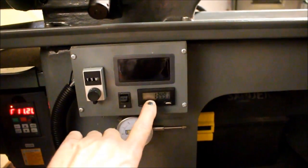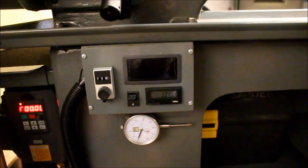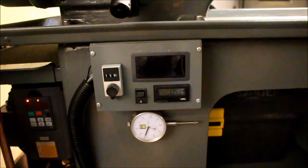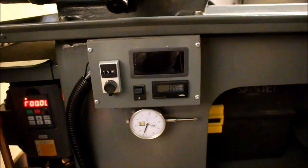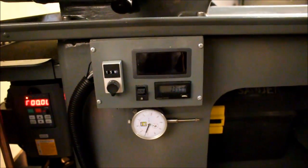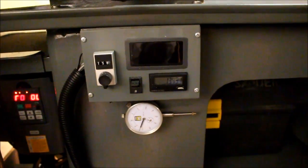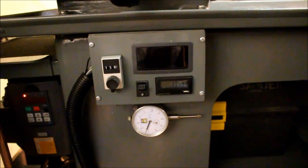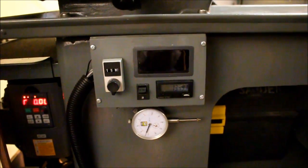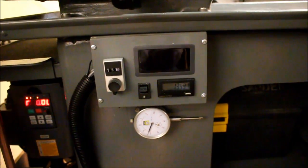And I also put a counter on it. Now, I doubt I'll ever use that counter again, but I did use it once. I had to wind a coil for a magnetic starter. It was a 120 volt, and I converted it to a 220, so I removed all the wire from the bobbin and got some 38 gauge wire and filled it up with 2,567 turns, and now I have a 220 coil for a magnetic starter.